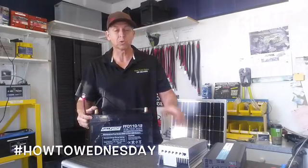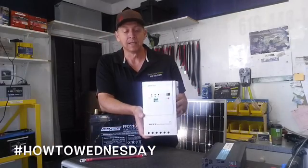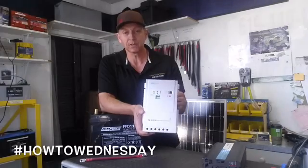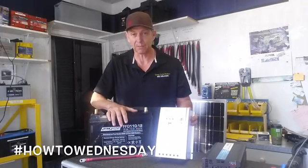That's my thing about solar. The key takeaway is: if you buy a solar kit, the most important component — believe it or not — is the charge controller. If you go cheap on the charge controller, it probably won't last, and it may not do a good job of charging your battery, which is what we depend upon.